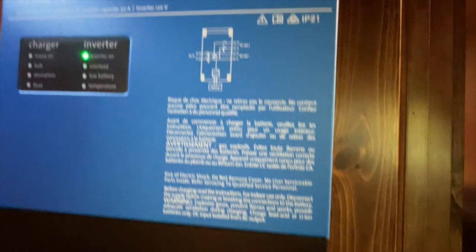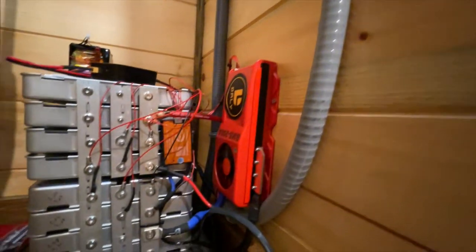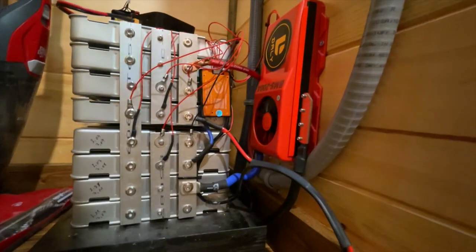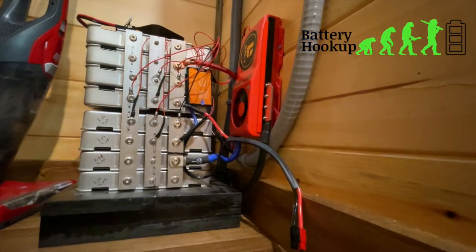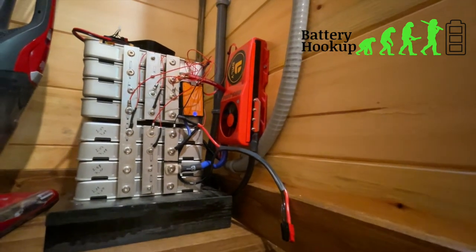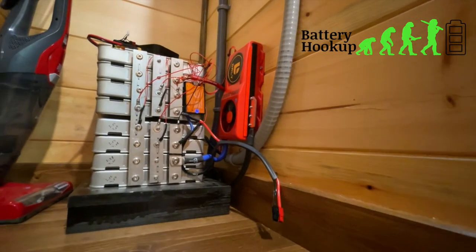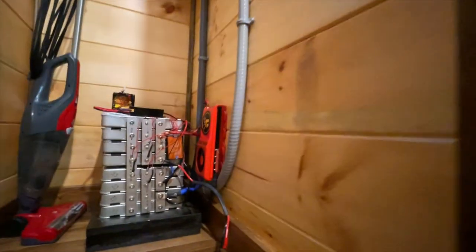From there it goes onto a bus power system, and from there into my inverter — this is a Multiplus 2, a 12 volt 3000 watt inverter from Victron. Everything is powered by my Nissan Leaf lithium cobalt manganese oxide battery that is recycled — I buy these from Battery Hookup, and I've got links in the description. I have two BMSs on it: one is 200 amps and the other is a 60 amp BMS.